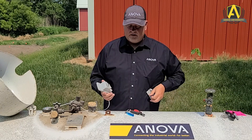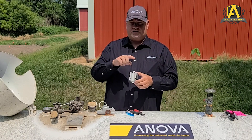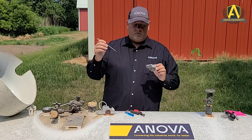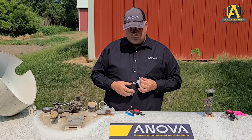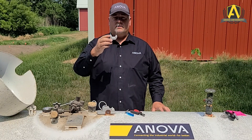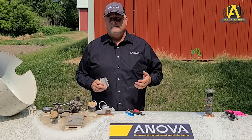Next step — we want to tip and install the mounting base on the back of the device. You might wonder why the back of the mounting plate is shaped concave with little holes — it's actually a benefit that some people use to install these against plumbing. Thread a zip tie through the top hole and out the bottom hole, do that on both top and bottom, and now you can use this to secure up against any plumbing. You can fit it on a relief valve, an underground tank, or even underneath the lid of an underground collar. It's a really handy zip tie channel to keep the UTM where it won't come into contact with the lid, water, or any moving parts.